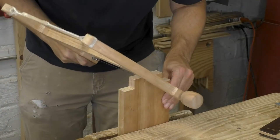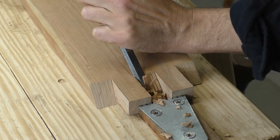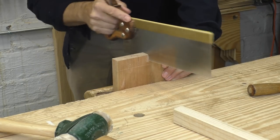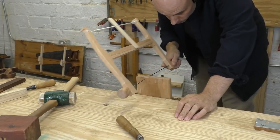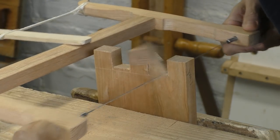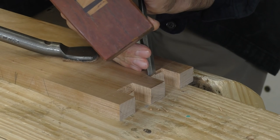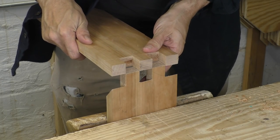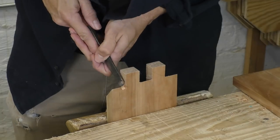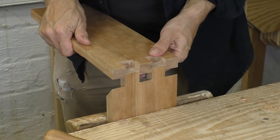So I need to cut away those angled sections and then re-cut them lower down. I'm not upset — I've made way bigger mistakes than this before. Pretty soon I'm remaking my sloped sections beneath neatly formed finger joints, and this side is almost done. On to the other side: I'll use a tenon saw to cut down to my baseline, but all the waste I want to remove is between pieces I want to keep. This is a great time to use my shop-made turning saw to take out most of the waste — it's got a super narrow blade that cuts quickly without crossing over into the stock I want to keep. Even the best saw will never give you a clean baseline, so I always leave a tiny bit of waste and chop that out with a small chisel. Now I need to actually fit the joints together. At first they don't fit at all, but that's actually good news — cutting the joint too tight means I can trim it and sneak up on a clean fit. I do this work in several rounds, just seeing where things are a little too fat and slowly paring off material until the joint slides together.